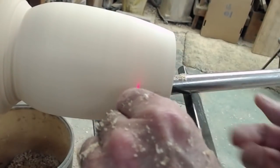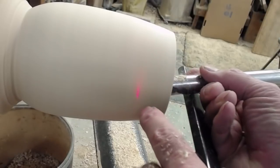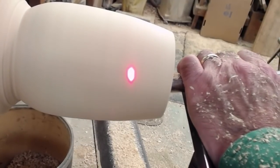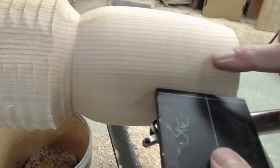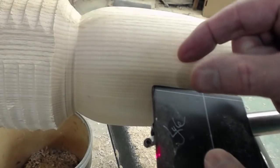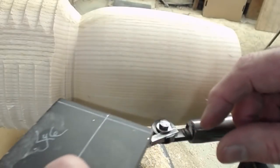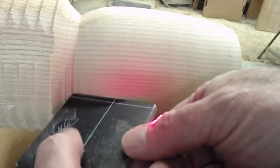Now I'm all measured there for about a half inch. I would go back and clean up the tool marks, but nobody's going to see it in here once I shut this thing up, so I'm not going to worry about it. I just want the wall thickness uniform, so I still need the laser to do that. This fairly straight surface didn't need any laser adjustment because the gap is perpendicular to the wall the whole way. But when I start to tuck around this corner, I'm going to have to reposition the laser so the gap stays perpendicular to the wall.